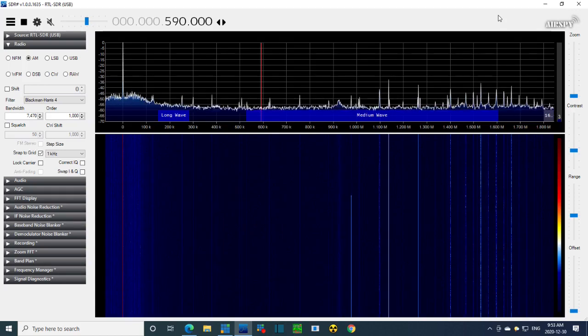That's a little odd. I'm just tuning, and then at some point up comes that. That is the signal from my signal generator. For some reason, as I turn the oscillator control, it's now working like it did before, more like just a tuned circuit. If you watch way out on the right side, I'm just tuning it back and forth, you can see it's got some kind of resonance effect. What happened to the local oscillator?